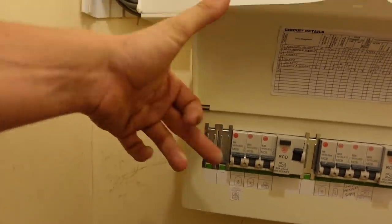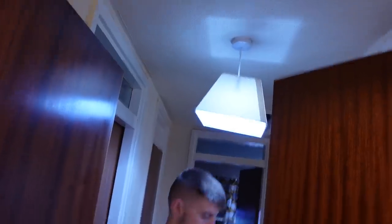We've ordered in here - it's been rewired recently, this year, all surface stuff. I think that's a local guy, he's a good guy. What we're going to do - look at this, nicely done - we'd like to see an isolation switch here for the shower. We'll label that up as well. We've got a 40 amp to go on the RCD side here, and yeah, should be pretty good. So we're going to notch a hole there, stick that on. Adam's going to go up - he's got the loft hatch already open over there.